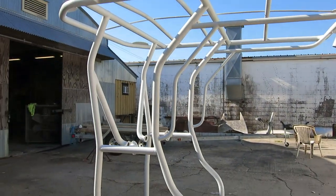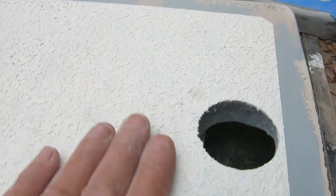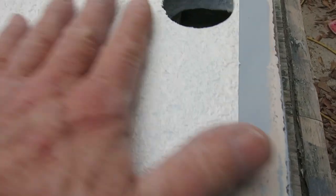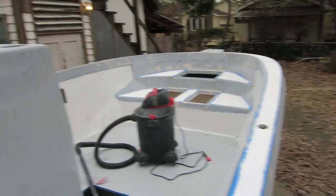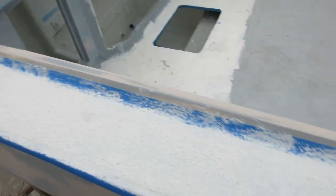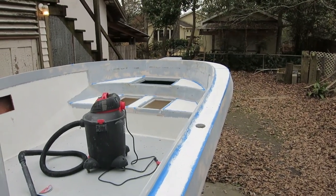I don't know how well you're going to be able to see this, but this is the texture when it's dry and it's a little sharp — it'd be a little uncomfortable with bare feet. So I hit it with 220 paper on a random orbital. This half is good; this half still needs a little sanding. Eventually it will all be painted the same color, so I didn't spend a lot of time tidying up the edges because I know once it's painted they won't show. Super happy — I've got three more hatches ready and I did all the cap rails and the flat areas up front. Paint coming soon. I've got to decide what kind of paint; I'm still a little skittish about making that decision because I don't have a lot of experience, but the non-skid I like.